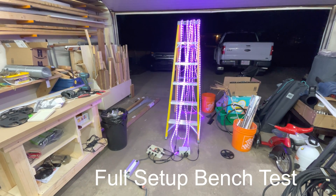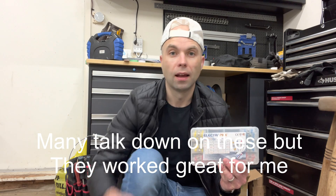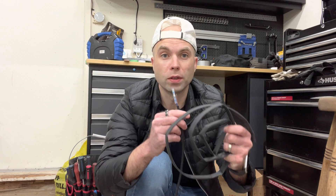The good news is we got it all set up and it works. One thing I forgot to mention was making the power cord to go from the dig quad on the main level up to the dig uno on the upper level. What I did is I took the Raywoo pigtail and the landscape wire and used these solder-seal connections. I say no soldering but this isn't really soldering — you take these little tubes, put the wire in one end, slip this over top, put the wire in the other end, and then use the heat gun to shrink it. I also took this heat shrink and put it over top so it was still a black connection that hides into the house a little better.